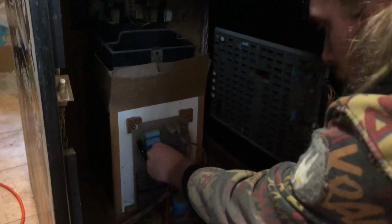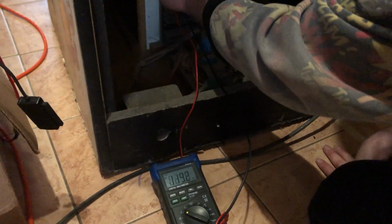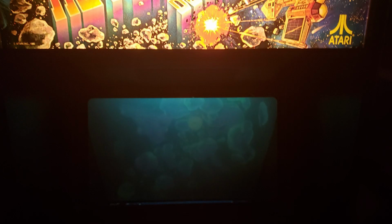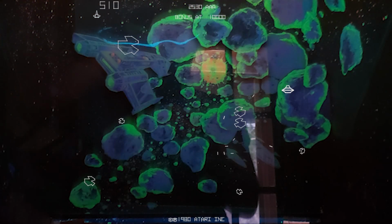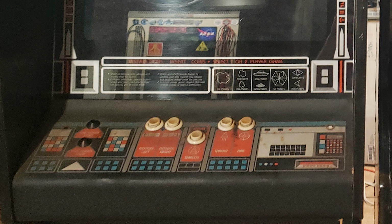Initial investigation showed the machine was by and large complete, but mostly dead. The power supply surprisingly worked fine, however the PCB was toasted. Everything within was coated in an impenetrable layer of dust. Dust, however, did not cloud the imagination of what it could be once cleaned, so we set to work, magic erasers in hand, with copious amounts of Windex, cleaning glass and vinyl alike, to remove damage done both by the sun and by, well, arcade smokers.